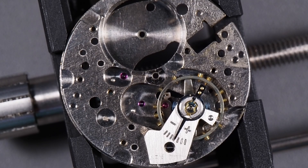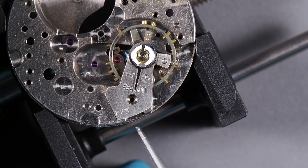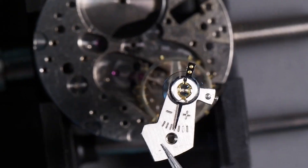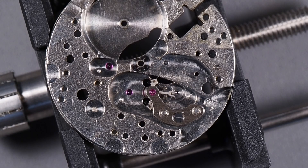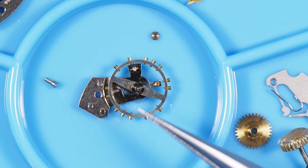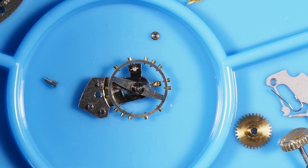I've reclosed the spring. Now I'm going to remove the screw that holds the balance cock in place and then remove the balance wheel and balance cock, because we need to get the pallet fork and pallet bridge out and they're underneath the balance wheel. Now we can lift the balance cock off — sometimes it's stuck and you might have to pry it up with a screwdriver using the little slot on the edge of the movement provided for that purpose, but this one is loose so we can pick it up. I lay the balance cock and balance wheel upside down in my parts tray, with the upper part of the balance staff into the hole where the jewel would be. That keeps the hairspring from getting distorted and keeps too much weight off the hairspring — it's a safer way to store the balance while waiting to clean it.